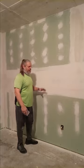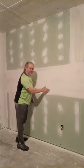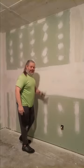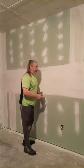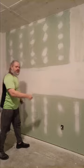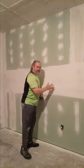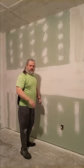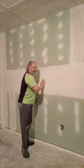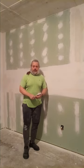Another quick tip, guys. When you're sanding, take time to run your hands over the surface — you can feel the imperfections. When you find an imperfection, mark it out. You'll see I have some marked here. It's also a good idea to take a light and shine it on the wall, which helps show the imperfections more easily, especially if you're in a dark area. That way you get a nice smooth finish by finding all the flaws and fixing them. Just a little tip for you guys.